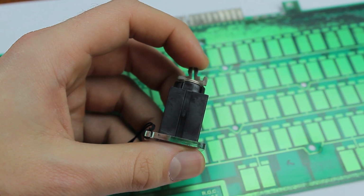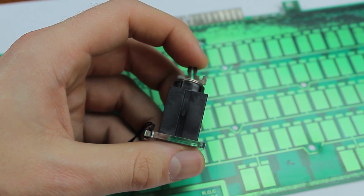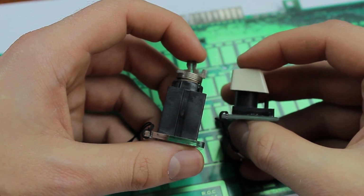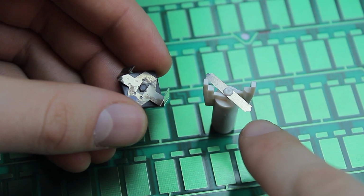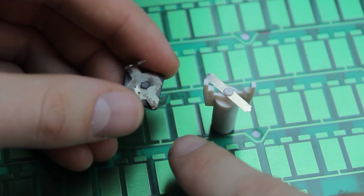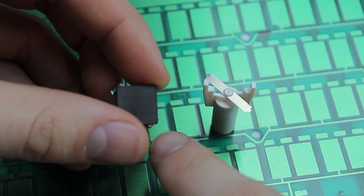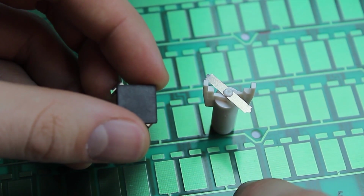The beamspring switch, or beam and fly spring interlock as IBM called them, are a rather complex design by Richard Hunter Harris, who also developed the later buckling springs that replaced them. The name comes from this plate spring or beam spring here, which is riveted to the slider and which interlocks with this fly spring below it. Fixed to the fly spring in turn is a fly plate, which is a square pad of conductive plastic that acts as a tertiary capacitive element to which the two capacitive plates on the PCB below respond.